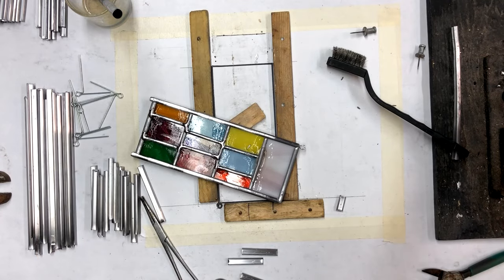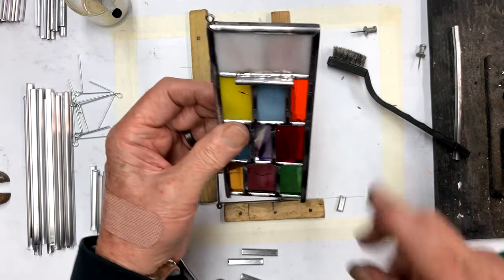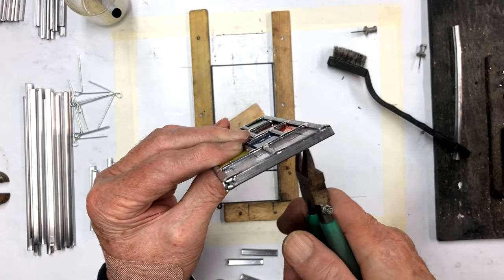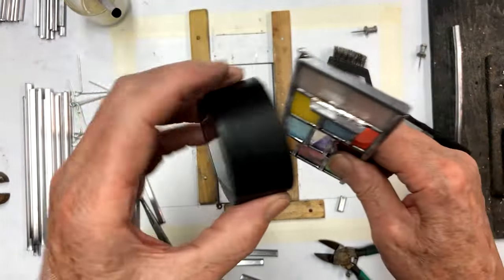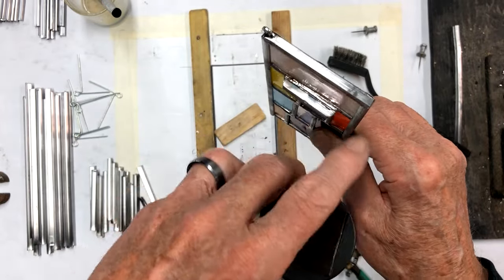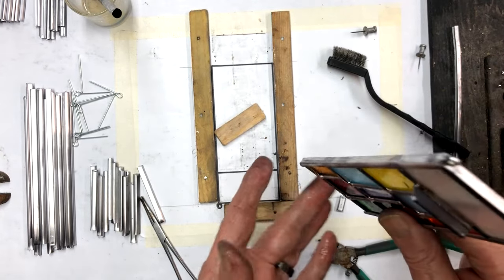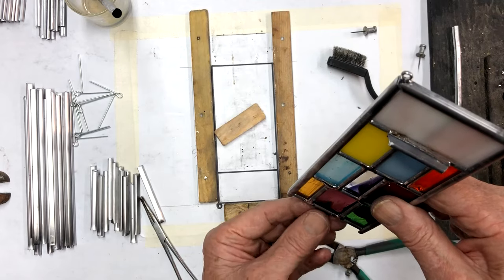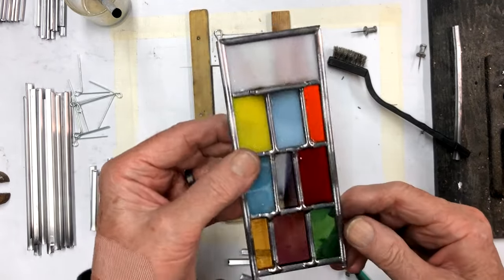I've got that soldered in there so you can get a good look at how that's going to look. These edges are kind of sharp, so I take my dikes at a 45 and trim these back just a little bit. When we have four of these together, this is where our solar light will rest on that cleat so it can't fall through our solar lanterns. I'll put one of these on each of the four panels. Down at the bottom I'm also going to put on a little cleat to hold in a piece of white opaque glass, which will give us some reflective bounce back. Since these lights are single source and go straight down, without a bottom the upper part is bright and it kind of falls off. By putting the bottom in, it bounces the light back.